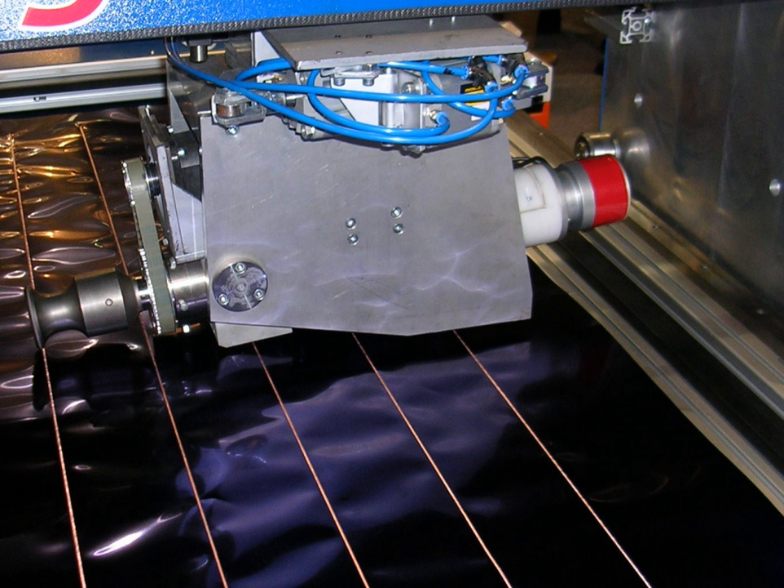The applications of ultrasonic welding are extensive and are found in many industries including electrical and computer, automotive and aerospace, medical, and packaging. Whether two items can be ultrasonically welded is determined by their thickness; if they are too thick, this process will not join them. This is the main obstacle in the welding of metals. However, wires, microcircuit connections, sheet metal, foils, ribbons and meshes are often joined using ultrasonic welding. Ultrasonic welding is a very popular technique for bonding thermoplastics — it is fast and easily automated with weld times often below one second, and there is no ventilation system required to remove heat or exhaust. This type of welding is often used to build assemblies that are too small, too complex, or too delicate for more common welding techniques.